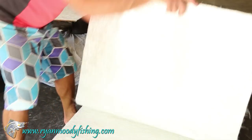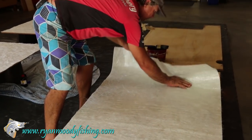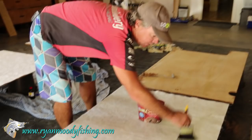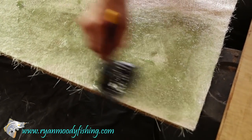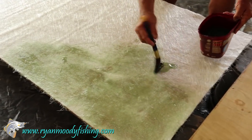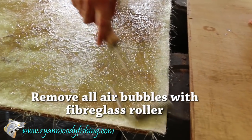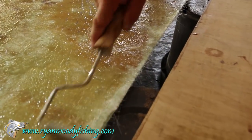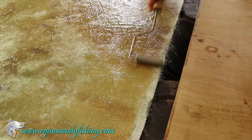Now we're going to fold that back. Just make sure it's over the ends in the right spot. From that halfway area I'm going to give it another good coat on top. Always make sure you put a big sheet of plastic on the ground or some spill mats like painters use. Now using the fiberglass roller, we roll all the fiberglass in right out to the edges — get all the air bubbles out so you see no white bits; it's got to be all green. Don't want any bubbles under there, otherwise it can delaminate and lift on you later on.